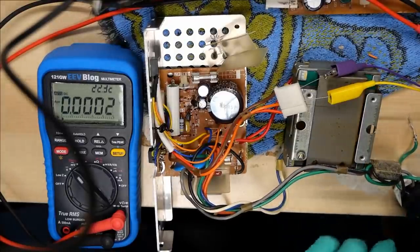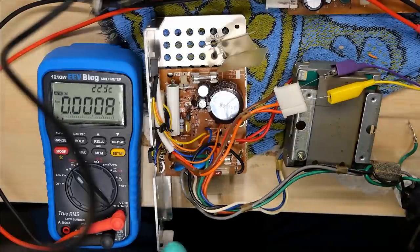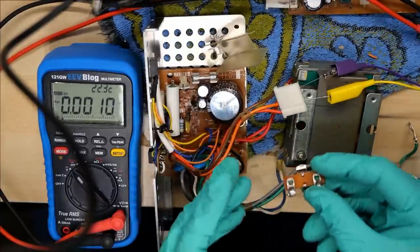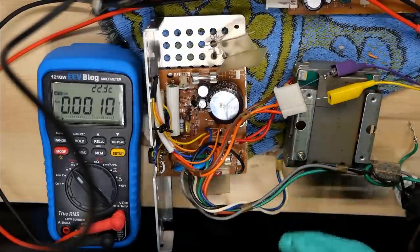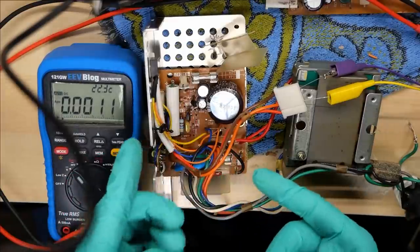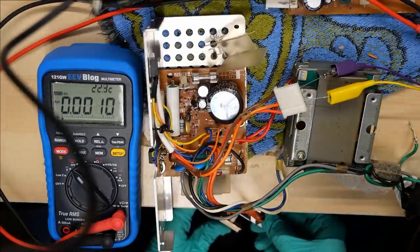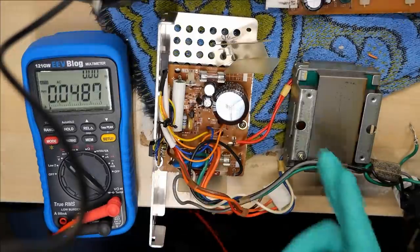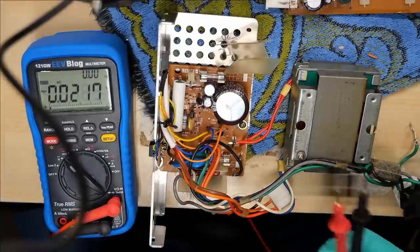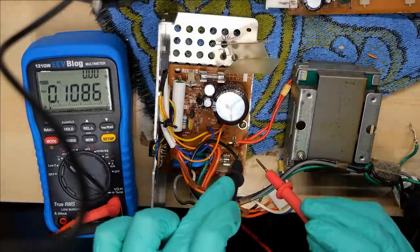Basically, I was able to trace that this brown wire is connected directly to the blue wire that was on the bridge rectifier. And what I'm going to do first is power this up disconnected from the main monitor and just check that I'm getting reasonable voltages out of here. I don't actually know what this should be, but it's probably going to be 12 volts and 5 volts, something like that. Here we go — I'm going to connect this up. The main switch is off. I do still have it on the isolation transformer. I have these pins hooked up to the multimeter. One thing to consider before I turn this on is that something obviously damaged these diodes. I'm assuming that this broke because the monitor was dropped and it was a physical shock that did that damage, not an overload. Both fuses were intact, so I'm feeling that it was just physical shock that killed those diodes. So let's give it a try. I want to see that the secondary on the transformer — these two red wires — is actually outputting some kind of an AC voltage when I turn the power switch on. 16 volts. Good. That's a reasonable amount.